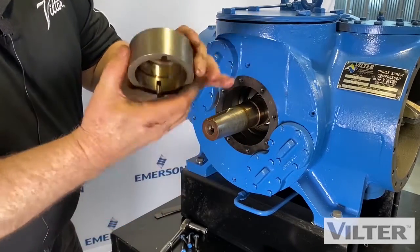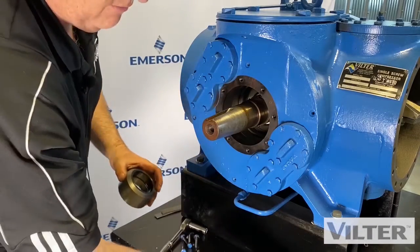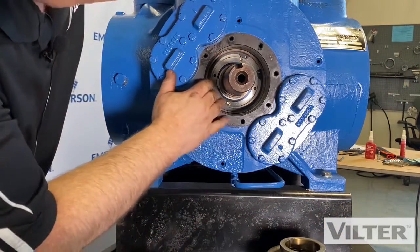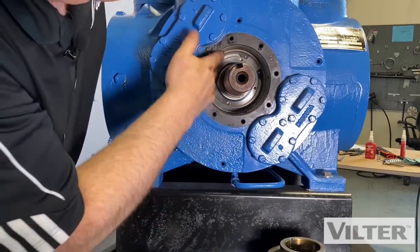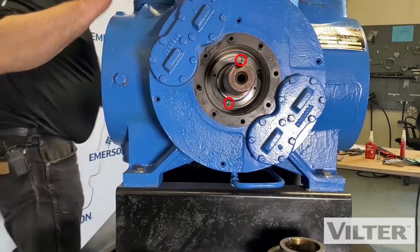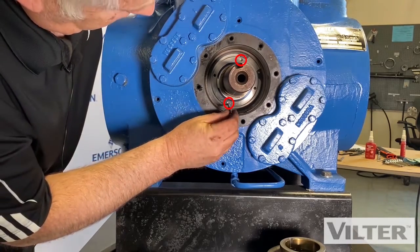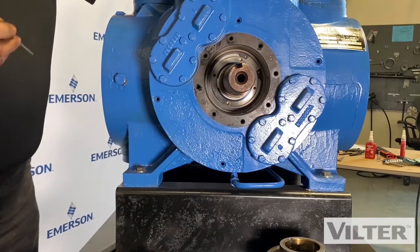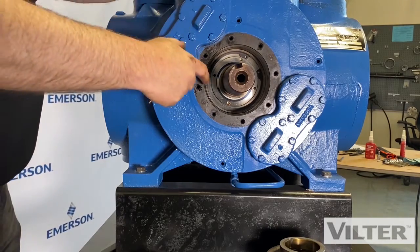There's a new o-ring — this part comes with the seal, that part comes with the seal, the lip seal comes with new o-rings. That's a kit. That's the sealing face. Inside here we have what we call a baffle plate, and there are four holes — two are threaded and two have check valves in them. What they do is allow oil to go and lubricate that back bearing, but the pressure will not come back and push the oil out of the seal chamber when the machine is off.